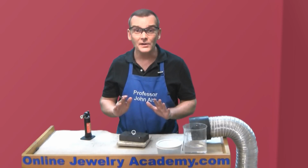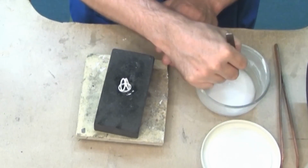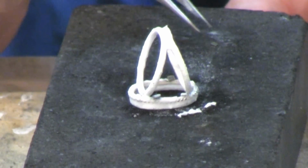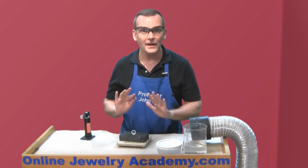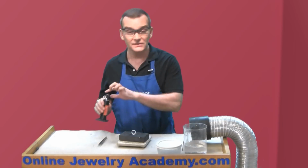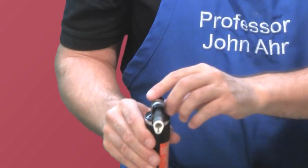Okay, I have my solder pallions in place now. Now, what you didn't see in the cutaway was I used the tweezers to dip the pallions back into the slurry to get them a little wet so that it would kind of melt the dried out flux that was already on the ring and just slip them into place. But now they're all there and we're ready to begin soldering. So what you want to do is just turn on your torch and heat the piece slowly so that the flux begins to melt and coat the piece. And then you just carry on as usual.